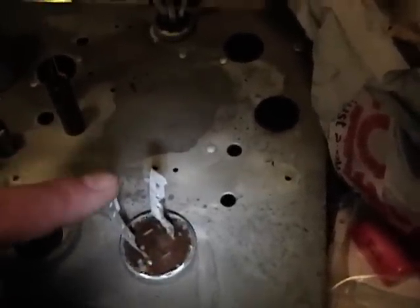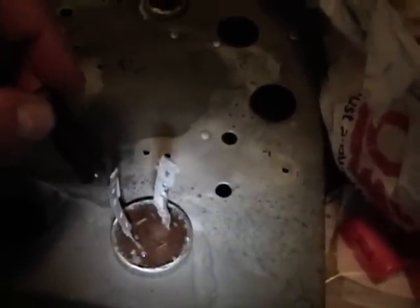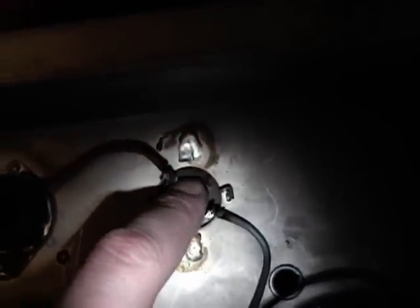The problem is that these studs are aluminum, and soldering to aluminum doesn't work very well. So I can't just tack one capacitor lead onto the stud and one to the base. What I'll do is cut these down close to the base and drill a small hole right next to each stud and one near the edge of the can, then run the leads through. On the underside, these studs are very easy to solder to, so the leads will come out right next to them and I'll wrap and solder in place so nobody will ever notice.